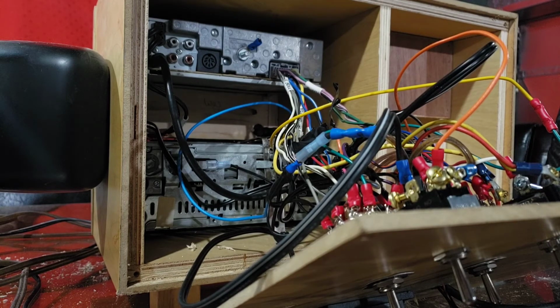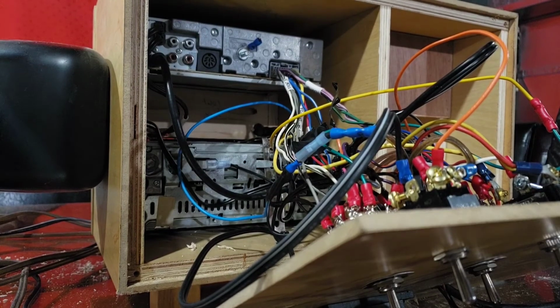So I just switched it around, and now the button's working the exact opposite, and that spent about 2 hours trying to figure that out probably. And it's all thanks to a cheap Chinese button which was faulty from factory. But on the other side, I can still use it, and the LED works now. It's just not the way I wanted it, and it took a bunch of my time. Don't cheap out on buttons, I guess.